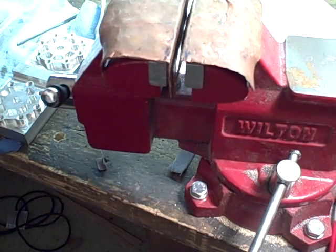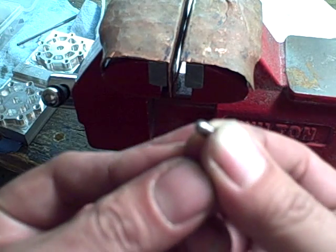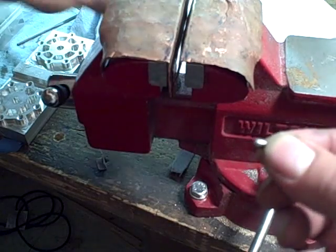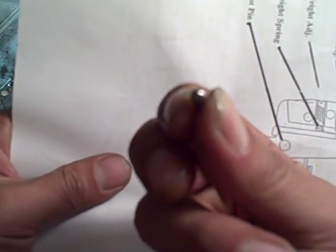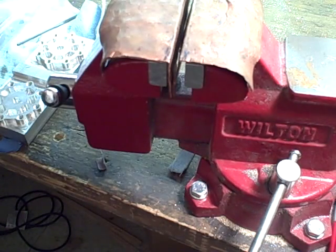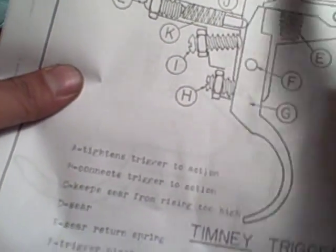I don't know if this will show up on camera, but I'll give it a shot. If you look at the front of this piece — with this white background — there's a small flat on the front. It's not completely round, so we have to clean that up. The other parts are right up here; these two parts have to be as smooth as possible, and also the part that this rides up and down on has to be as smooth as possible.